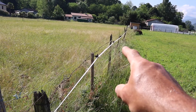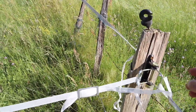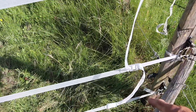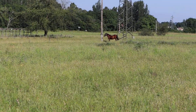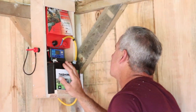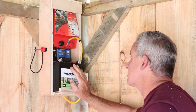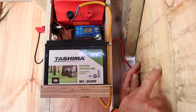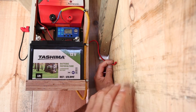I've got the feeder line here all the way from the field shelter where the battery and everything is, coming down to here. It's isolated from the wooden post with these insulators, and I've got it connecting across — there's a good connection there but I've added an extra strand of wire, and then it attaches to the three wires which go right across the field — all of this to try and persuade Tyson to use the field shelter I built for him. We're getting 12.8 volts now; it started at 12.5, so the solar panel is working pretty well. It's a tiny 10 watt solar unit. I've left a tail here and I'm going to put a junction box there so if I want to run any 12 volt LEDs or the water pump I can just run things into there, but for now I've just put some tape on.